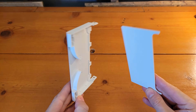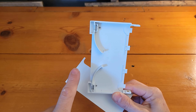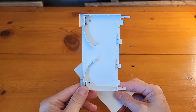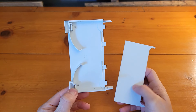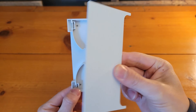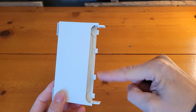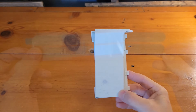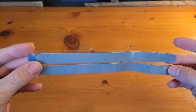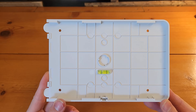There's also a bridge and cover included for use with the mullion mount or glass mount when running the cable out the side of the scheduler instead of through a wall — especially important when mounting to glass. This attaches to the side of the multi-surface mount so you can run the cable through, bridging the gap between the wall and the scheduler. The cover clips into the top for a clean look with no visible cabling. Finally, for glass mounting, two strips of strong adhesive are included to ensure the multi-surface mount sticks securely to the glass.